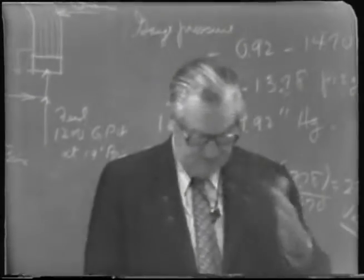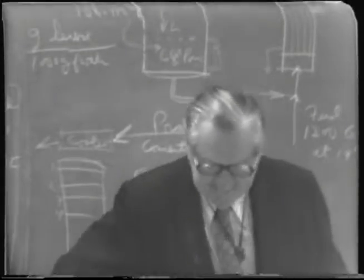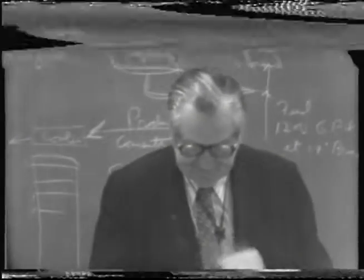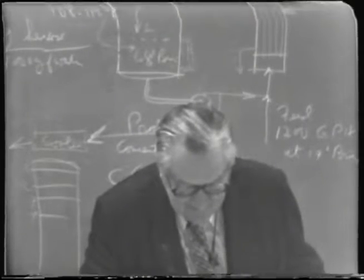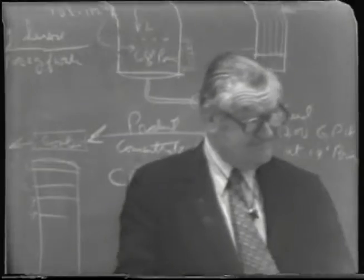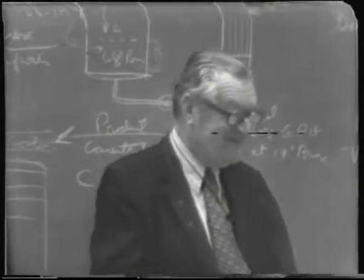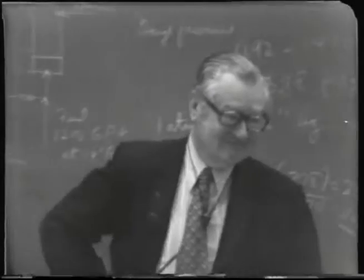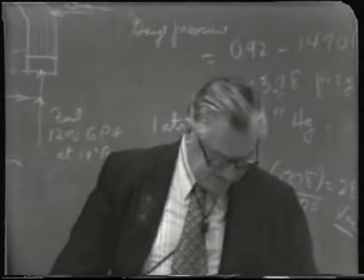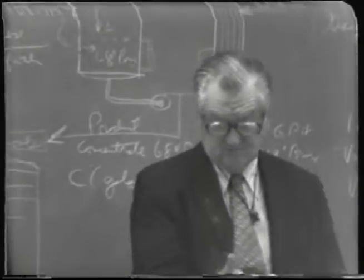But in the case of our industry, the alcohol industry, 5 mole percent, what does that mean? If you had a bottoms product of 5 mole percent, according to my tables here, that would be about 12% by weight, 13 or 14% by volume. What realistic situation could we have where that'd be? It's a non-realistic situation. So I've given you a real situation, and it does make the steps very small down the stripping section. So anyway, that's why I've given you this slightly more complicated plot.